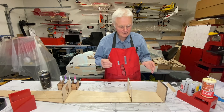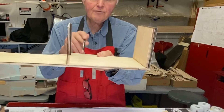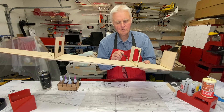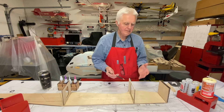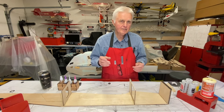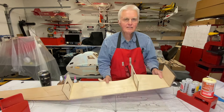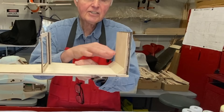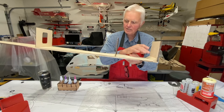The other thing I want to mention since I'm talking about gluing is you may notice these glue joints – there is no visible glue on the outside. When you're gluing it on, invariably glue will squeeze out, and in this particular case it was important to wipe the glue away. It was epoxy, so a wet paper towel works, or even a bit of denatured alcohol on the paper towel – wipe it clean. The reason is we're going to strengthen these bulkheads with triangular stock, like a gusset, and because there's no glue in that joint, it fits perfectly tight, giving you the maximum strength benefit.